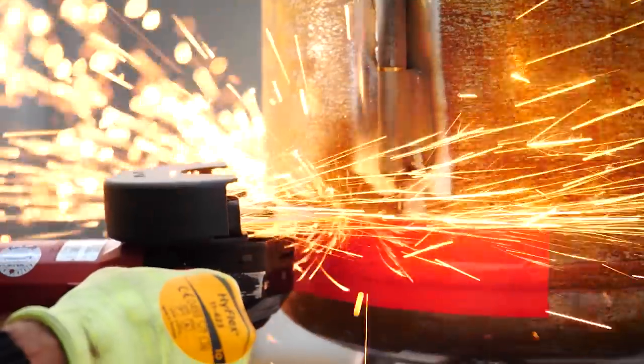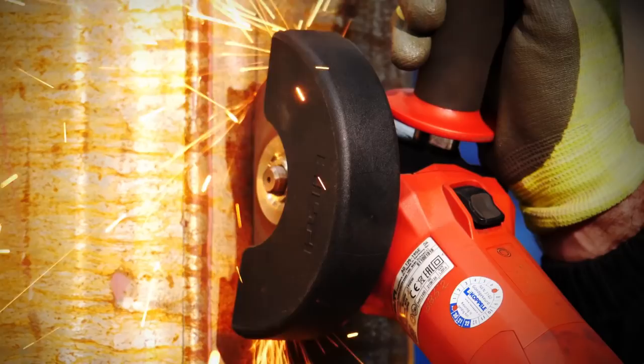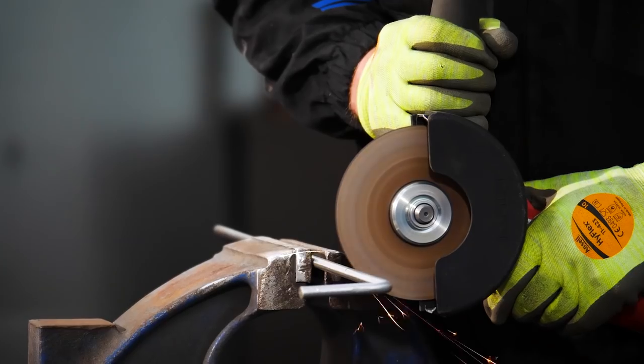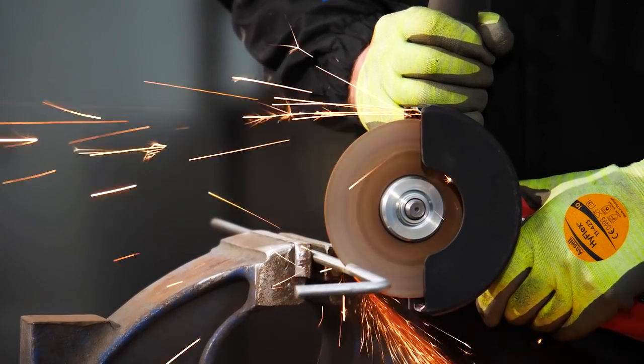The hinges are in place so I'm going to cut the rest of the door. To complete the door I'm bending the carbon steel dowel to a 90 degree angle, then after cutting, I weld the dowel onto the latch plate and directly onto the door to create the handle.